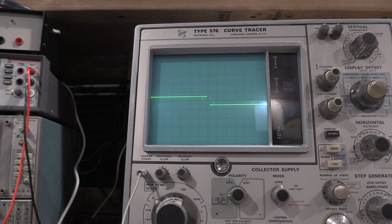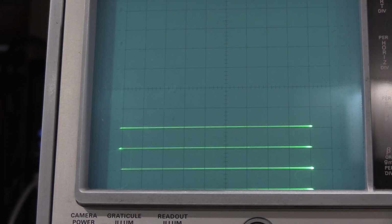The newer calibration routine, there was a lot wrong in there. You're actually supposed to have the horizontal value set to 10x. That's how you get the numbers here to line up with the different settings. So there's a lot of errors in the other calibration documents. So there we are. So I will continue with the older calibration document now, going with the calibration fixture, and we shall continue on. Okay, so setting the delay, what you want is everything lined up right here at this end. So I've got that one set. And we will move on to the 0-step level.